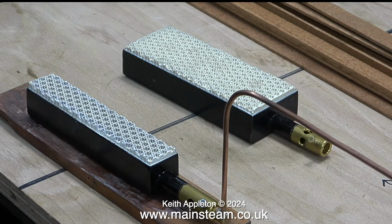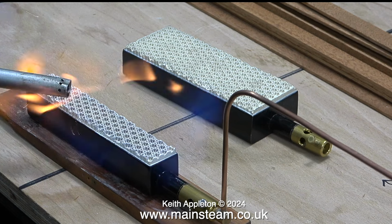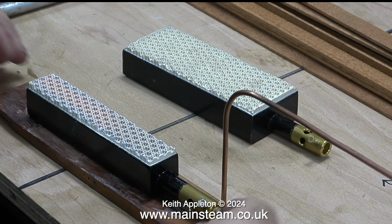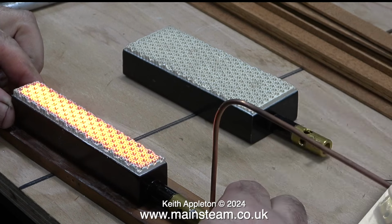This burner is going to be used in a Stuart 500 boiler application. The one behind it is the larger type for a Stuart 504 boiler. In this clip I've set it so you can just see the nozzle of the jet through the hole in the Venturi pipe, and now it's lit and burning nicely.